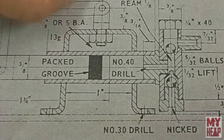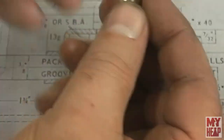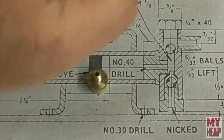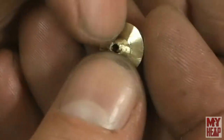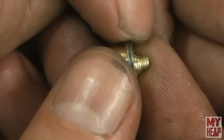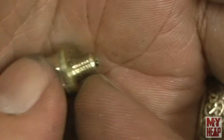This is really all I managed to get done today - this one piece. It goes into the body of the housing and then this gets screwed into the pump valve. The reason I'm stopping here is that if we can get a good look at this, you'll see that those threads tore right away. The hole drilled through it made it quite weak - probably leaving such a thin wall there, that hole should have been left to last. This one here turned out pretty good - that's the keeper part.